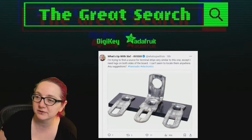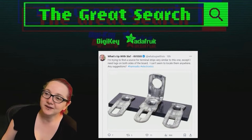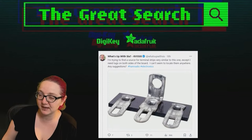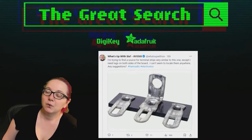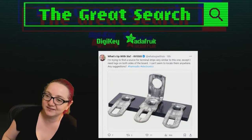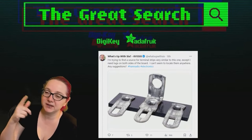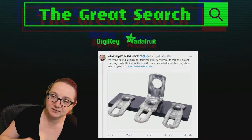So this is a terminal strip. Most people are familiar with terminal blocks — we use a screw terminal and a screwdriver to attach wires and you can solder them in. These terminal strips are kind of like an ancient technology. They have these solder lugs — those little things that stick out have holes, so you can put a wire through and wrap it for a strong mechanical connection. They're meant to let you attach three or four wires for multipoint connections. That middle one with a little tab is ground — you attach that to your chassis ground — and then you'd have power, signal, and ground. You solder them in and you're good to go.